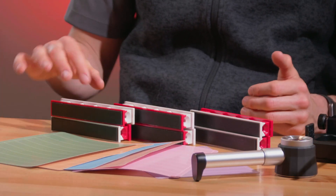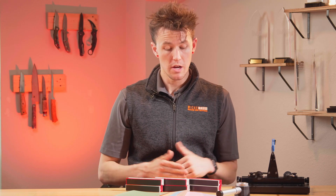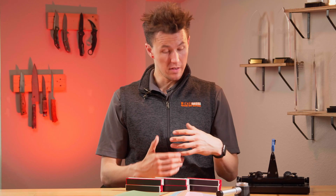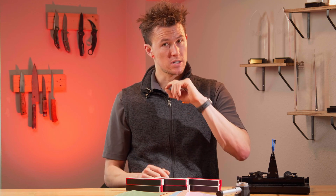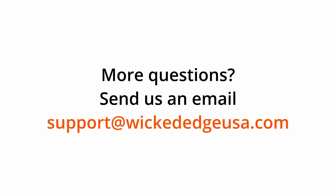If you purchased the Convex Ultimate Kit, you're going to get everything that came with the convex creation kit — namely the 30 and 15 micron lapping films, a pair of handles, and your jeweler's loupe — but you're also going to get the tools to take your convex edge to a much higher polish: two more sets of handles and nine, six, three, and one micron lapping films. To make use of these extra resources, just continue with your grit progression going numerically smaller. It's the exact same process as you used in your convex creation — with each lapping film, go until you remove all of the scratches down the center of that bevel from the previous grit, then clean your blade really well and move on to the next smallest grit. This will leave you with a really beautiful mirror-polished edge by the time you get all the way to that one micron. Enjoy your extra durable edge and don't hesitate to reach out below with any questions.